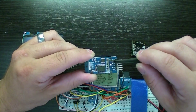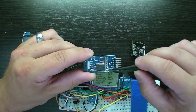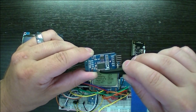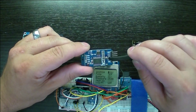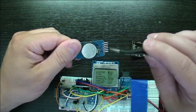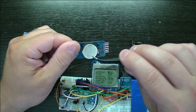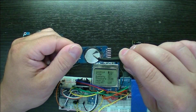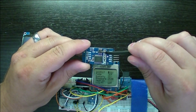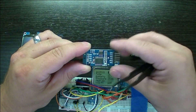Everything else — these two resistor networks, the 32K dual EEPROM, the power light, and the battery charging circuit — has been removed. So I've got four total components on it. This way it doesn't draw power from the battery; just use a regular 2032 battery. And I have no need for the dual EEPROM, so to keep power consumption low, I removed that as well.